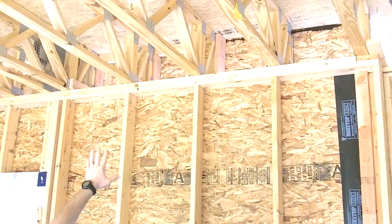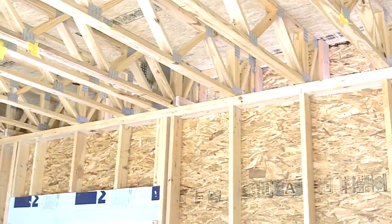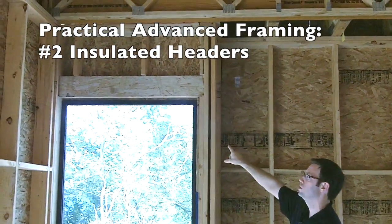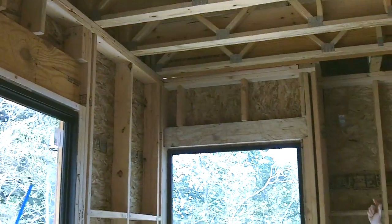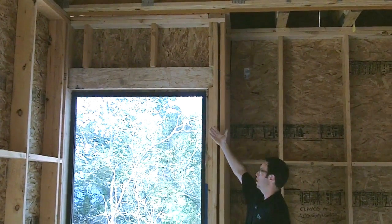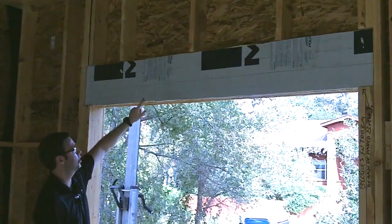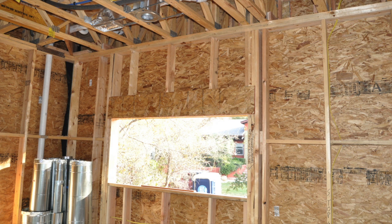You can see our floor joists up there — these are 2x4 trusses used for floor joists, and they've landed on a stud nicely. Our headers are mainly timber strand engineered headers, and we do have a few LVL headers in some other places. When we frame with a 2x6 exterior cavity, that header fits in basically a 2x4 space, leaving us 2 inches from the outside face of the header to the sheetrock. We've started insulating that header cavity — one layer of 3/4-inch exterior rigid foam, and we'll add another layer of 3/4-inch and then a half-inch plywood on top, making it flush. That will be an R10 header, which is fantastic.